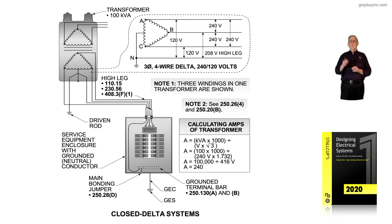Per 240.4B we could round up from 240 to 250 to size the overcurrent protection device from table 240.6A. But one has to remember only 240 amps could be used, though you could use all 240 amps of the conductor chosen. Keep this in mind: are you rounding up or rounding down, and exactly how many amps do you need? Do you want to protect the conductor and the system completely? Figure 4-5 illustrates a closed delta connected system.